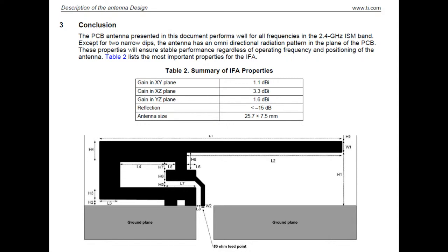Nothing is going to beat a printed PCB antenna for price, but you can do better than that. Get this 3D stamped antenna and pick and place it on your design - they're not very big. When I see a lot of people using these antennas, I know there must be something good going on. I know a lot of folks use ceramic antennas or 3D antennas, and sometimes your space requirements dictate that. But if you have a little bit of space and the height doesn't bother you, check out these antennas. I'm looking forward to designing one into my next Wi-Fi or Bluetooth design.